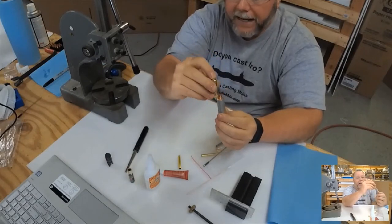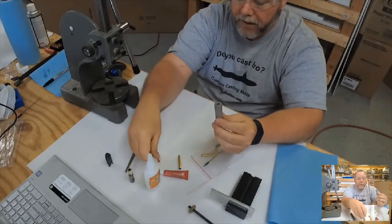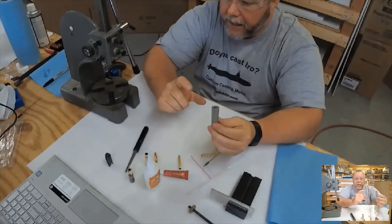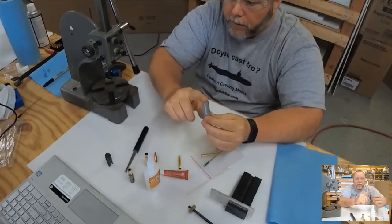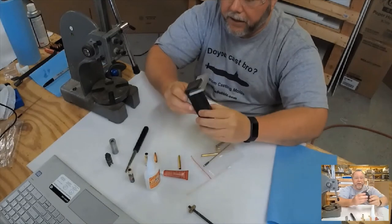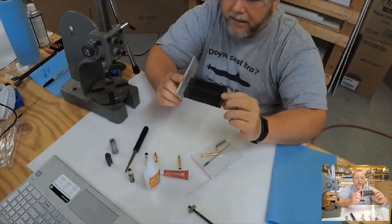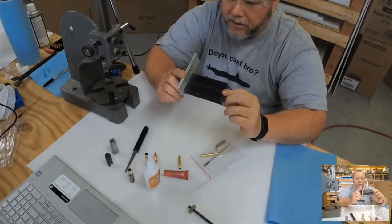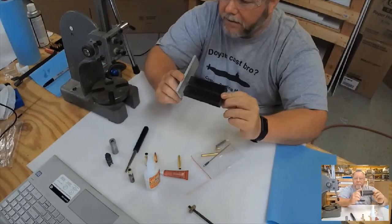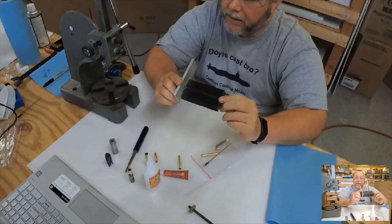Every casing that leaves my shop is the same. Once you determine the depth you like, drill a piece of wood or aluminum to that depth so you can always get the same press. The other thing you'll see me use is this Frankenstein-looking thing — it allows me to press my transmission to the proper depth without guessing. How many of you make slimline pens and press to the second line, then find it needs just a little more — or you pressed too far? Yeah, that's easy to pull back out.